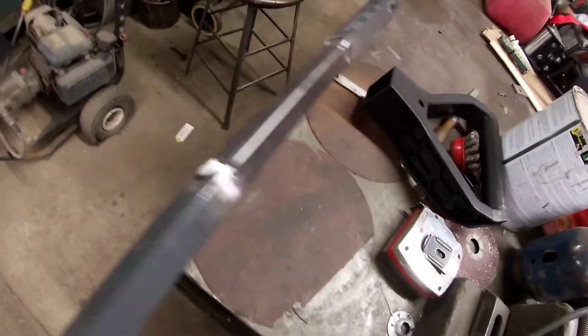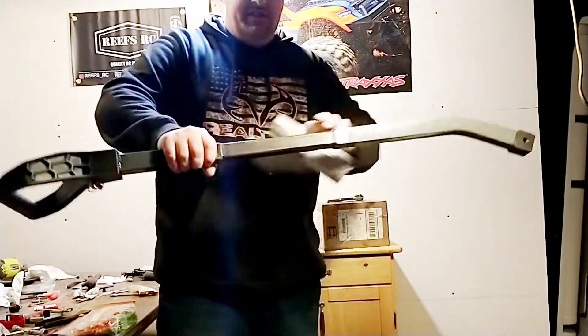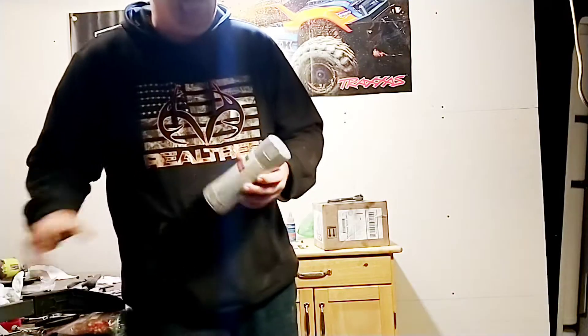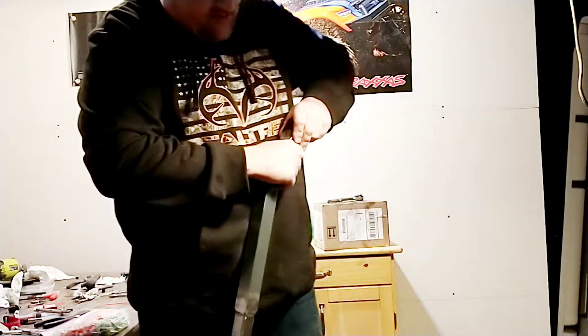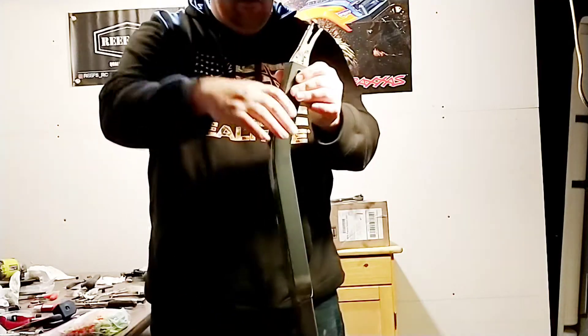She's all cleaned up — all I'm gonna do is add some paint and she'll be ready to go. I'm in the basement now. We've got this silver metal or aluminum spray paint — kind of a lighter gray. We just need to paint this piece of bare steel and on each end where we welded and ground it down, just so it doesn't rust. It's not going to be an exact match but it'll be totally fine for the wagon. My buddy will be fine with a little mismatching paint. I'll take the plastic handle off, grab onto this end with a pair of vice grips so I don't have to touch the wet paint while I'm spraying.